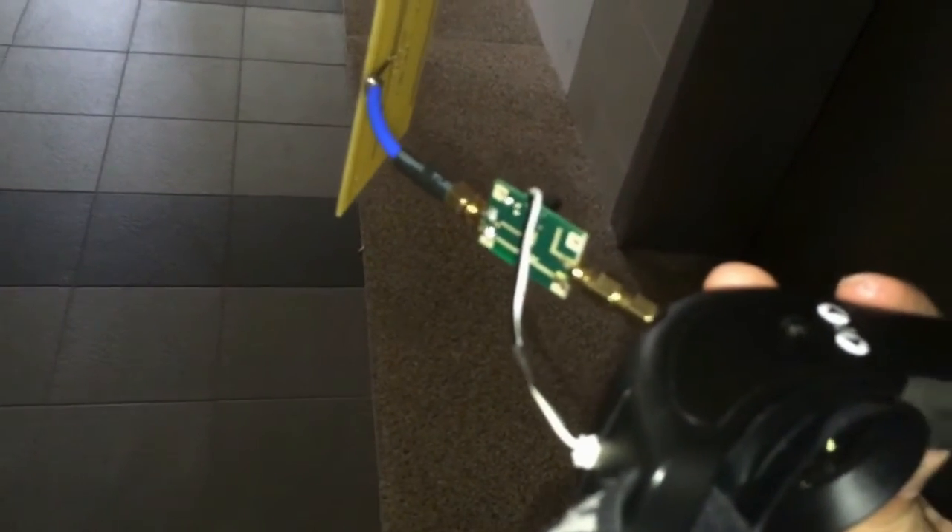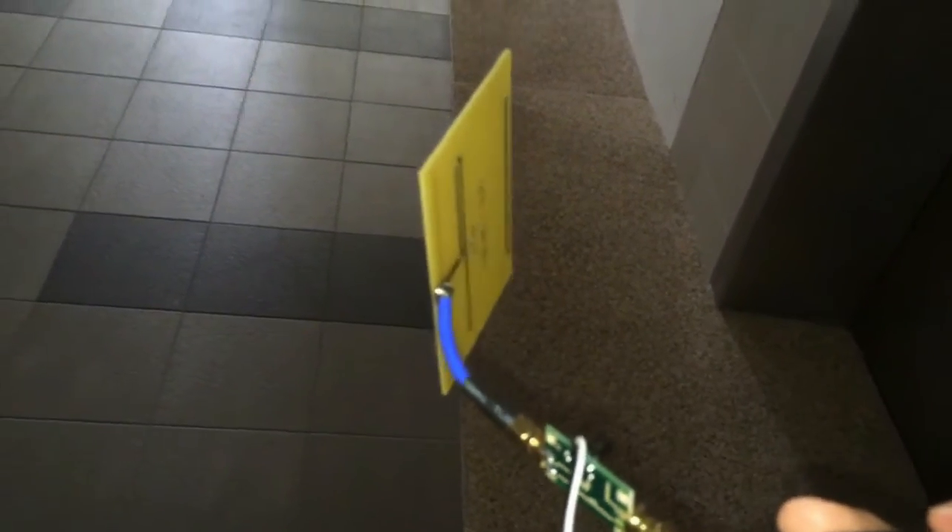Okay, now I'm still at the same spot. This time I have the LNA — low noise amplifier — on my Fatshark goggles, and the same Yagi. Now let's take a look at the live footage with the amplifier. This is how the live transmission looks like with the LNA. A lot better. There's less snow compared to just now — some horizontal white noise, probably due to the noise of the LNA itself, but the image is definitely much better than before.